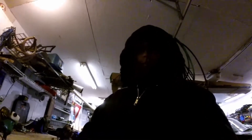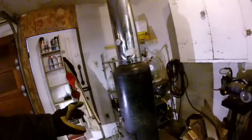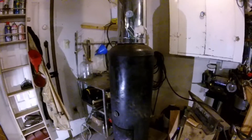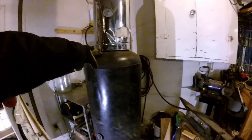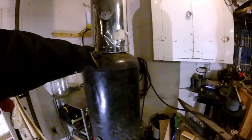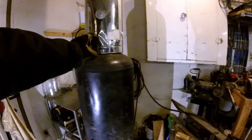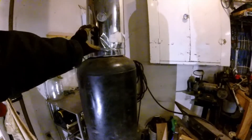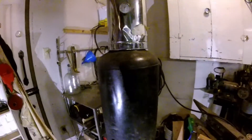Hello YouTube. A couple of guys have asked for more detail on how this furnace works and how I plumbed it together. It is a 100-pound propane tank. I took a jigsaw with a metal blade and cut the center off the top where the valving is, then welded on a six-inch pipe roughly three or four inches tall so we could sleeve this chimney on top of it so it wouldn't move — it's kind of one unit.